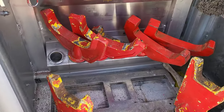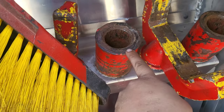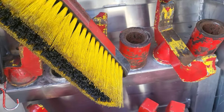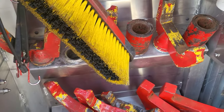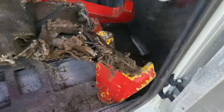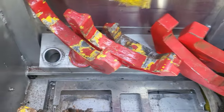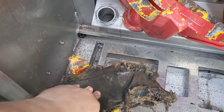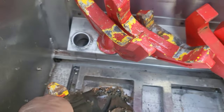These are some of the other forks for different size things that you need to fork. These are the cups I was telling you about - those bolts sit right in there and you run chains or straps over it to secure it so it doesn't pop out. You always run chains or straps over any of the forks so they don't pop out. Sometimes you put fire hose on top of the forks so that wherever whatever we're towing, it's metal on metal, it doesn't slide back and forth - it has more resistance. We stuff that in there and then lay the axle on top.